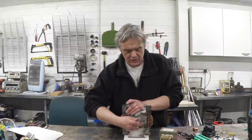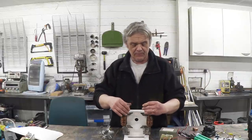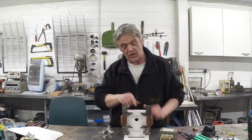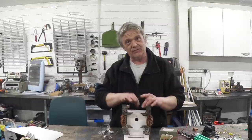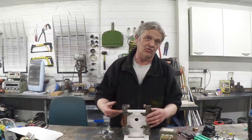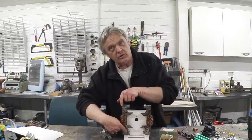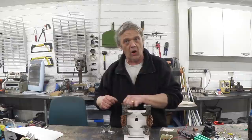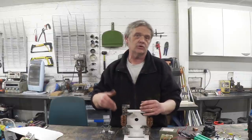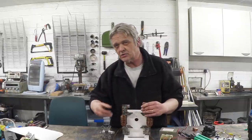A diagram of how it actually works. In terms of construction you can see the four poles, the two coils, and here I've got the magnets — there aren't enough magnets to fill this entire gap. It would be made slightly better if we put something in between there so that we have a magnetic flux between the north and the south on this set of magnets, but it's not strictly necessary because we rotated it and it still generated. As long as both of these are south and both of these are north it doesn't really matter whether this is completed or not. If you have a whole load of magnets or a bar of steel in here it's going to do a better job, but it isn't strictly necessary.